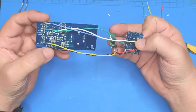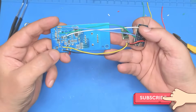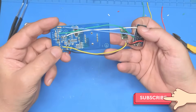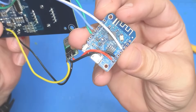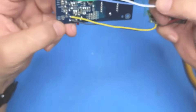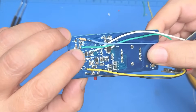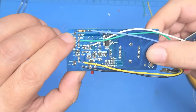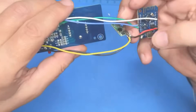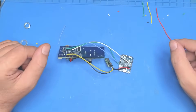Most of the magic is done in the code. To summarize: we've taken the 24 volts coming into the unit, run it off this board through a regulator to get five volts, then onto the five volts and ground of the D1 Mini. The MOSFET signal to energize the fan, the PWM pulse signal to govern the speed, and coming back the blue wire which is a pulse from the fan - all going into the D1 Mini. Next we'll tidy up and get some code going.